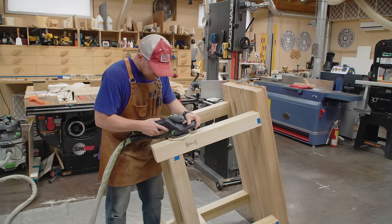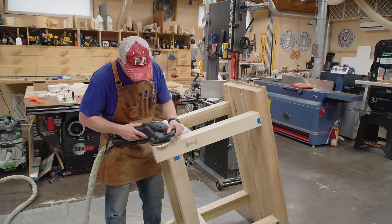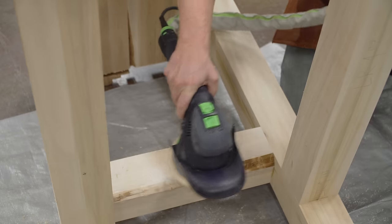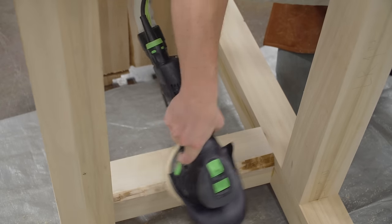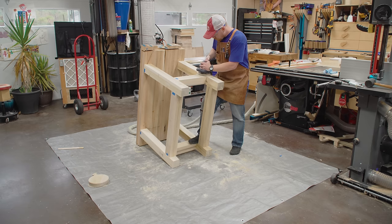As I'm rolling this around, it makes sense to go ahead and start sanding the base as I go. In this case I'm not trying to be perfect — I'm only using 80 grit. I know the base is going to be painted, so I'm not worried at all about swirls or making it perfect. I just want smooth surfaces.